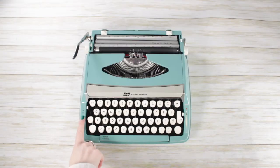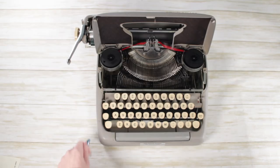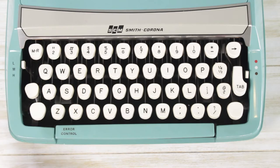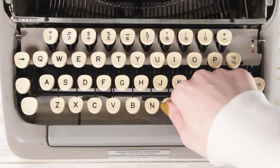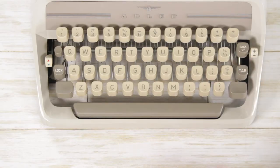Here's something else you might see on a keyboard of your typewriter: the L-M-H lever, or a plus and minus lever. This is actually called the touch control by Royal, or the touch selector, and it allows you to change the tension or weight of the keys. On some machines this will be a lever on the keyboard, on others it may be under the hood with a series of numbers, and others may have a knob on the side to adjust this tension. The difference may be minimal, but you might want to play with this and see which setting you're most comfortable using.